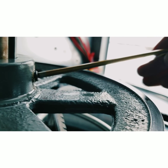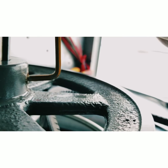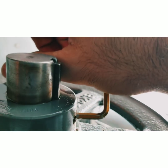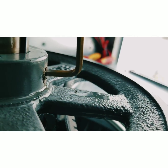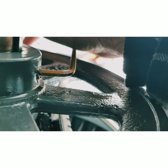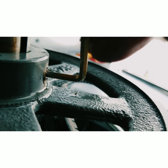We're going to tighten that allen screw down and then go back and forth on the key — you can see the key sitting between the shaft and the pulley. We're going to go back and forth on it a few times. What that's doing is leaving a groove into that key so the allen screw is going to sit in it. Do that a few times and then give it one last tighten.